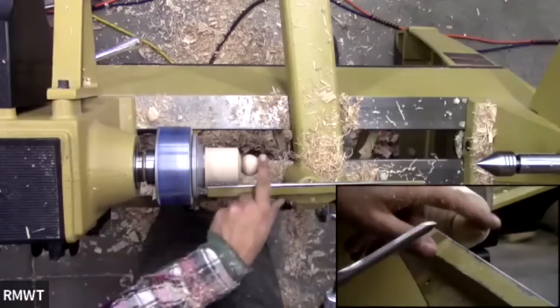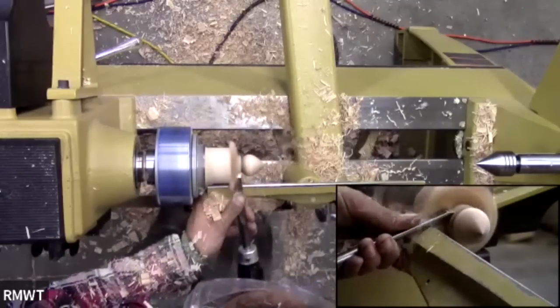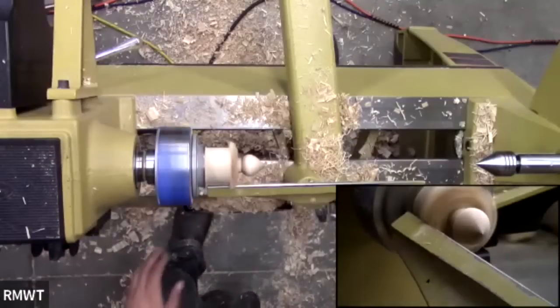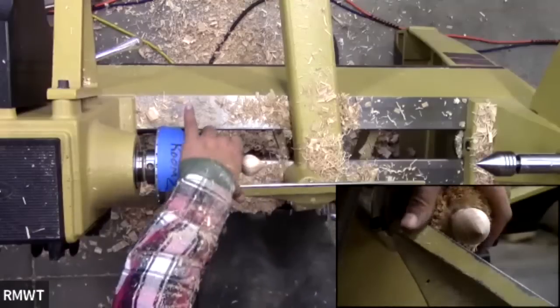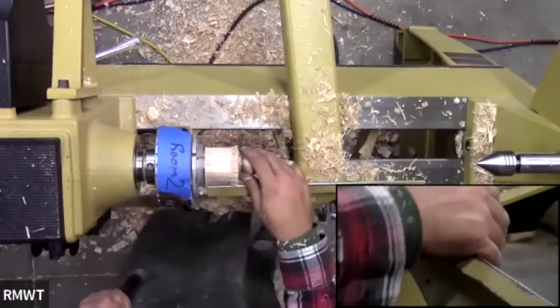So we want to just kind of create a nice shear cut surface across all of this. Now we're just going ahead and doing the same thing that we just showed before. These nasty fibers, end grain fibers of elm. If you tear them out, they will. Oh, they're nasty. But it's good to see that for the sake of a demo, to see something like this, and also see in contrast what's a nice shear cut.